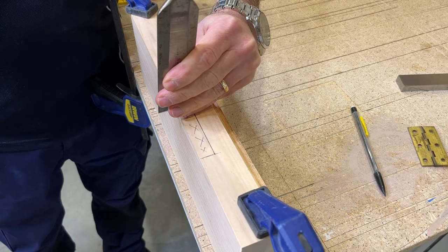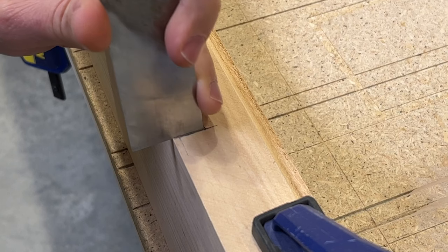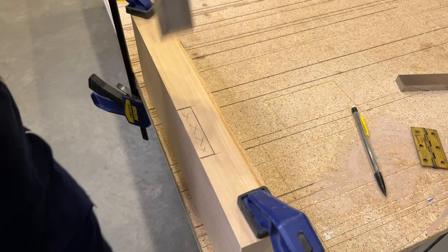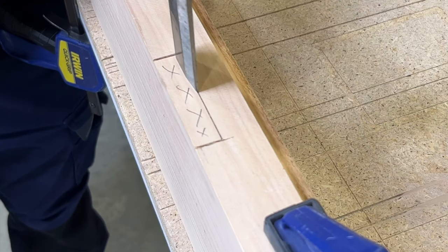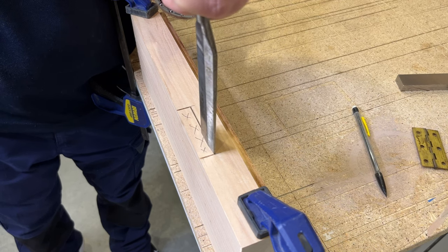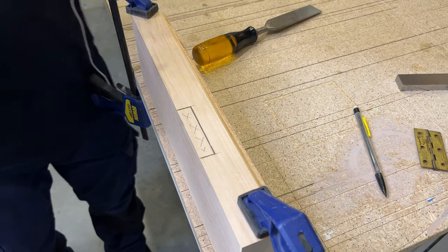When it comes to the chiseling procedure, I'm going to get a wide chisel and place it just on the inside of my lines, because the chisel will tend to drift due to its edge. I carefully tap it down — not too deep — just to leave a nice clean impression, following my lines all the way across. For that back line, because I used a marking gauge, it's already scored a little groove into the timber, making it easier for the chisel to fall into place. This first step is just lightly hitting the chisel all the way around on your markings.